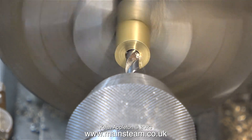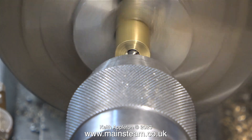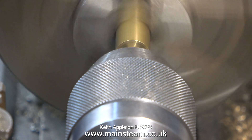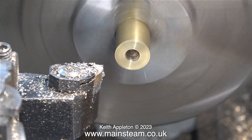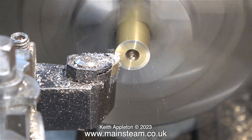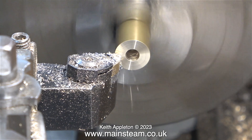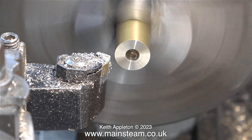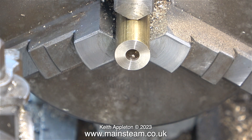I'm not going to leave you on a cliffhanger — I'll show you what I'm going to do in the next episode. First, centre drill a piece of brass, then drill it tapping size for quarter by 40 all the way through, which is 7/32 of an inch. At this stage I haven't threaded the piece of bar — it just looks that way because the drill has left some rings in it. As usual I'm going to face across the end using the carbide tipped negative rake tool, which gives a great finish one way and a terrible finish the other. Because this is a much thicker, more rigid piece of brass, it's not as bad as when I faced the end of the uprights.